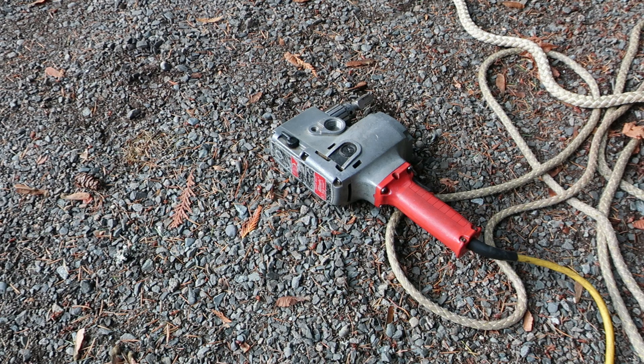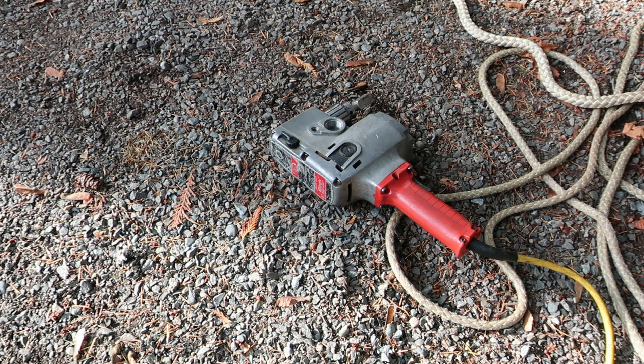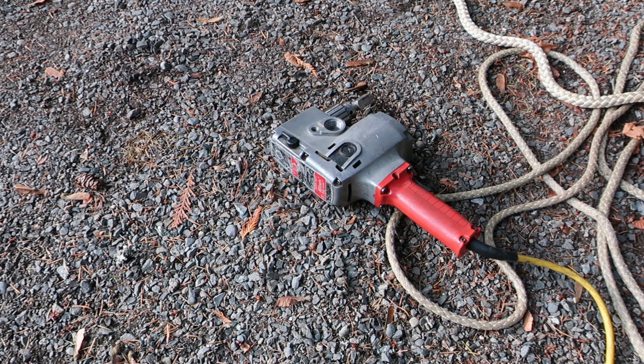The winches are two-speed, so you've got that going for you. Sometimes I run it with a drill — a Milwaukee corded drill that's really slow, also two-speed and bi-directional — so you've got four speeds and don't have to do any physical work. It's a little awkward using the drill and self-tailing the winches, but you can do it three feet at a time and re-grab the rope. If you're not moving much weight, the hand crank isn't much work. With no weight on the boom, you can just pull the rope around the windlass drum and it'll pull itself up with no problem.